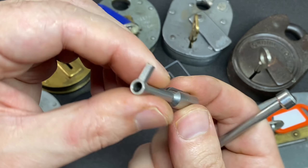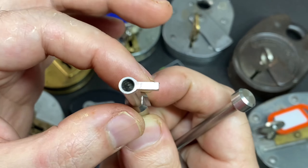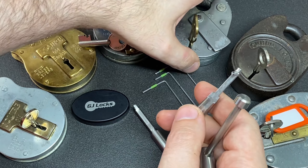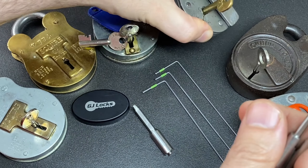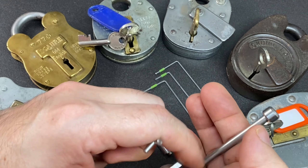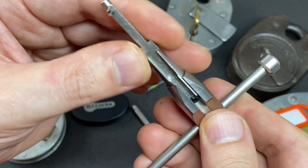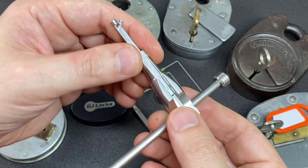This one is a piped tip — so this is a piped key. It looks like a pipe. There is an upstand or post in the center of some locks, and that's why we need a piped tensioning tip. And here you have a tip for non-piped keyways, which works the same way — make sure it slides into the back, finger-tight, and it's not going to go anywhere.